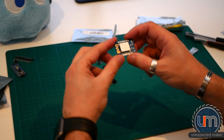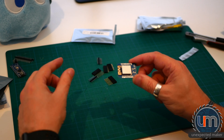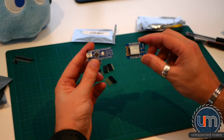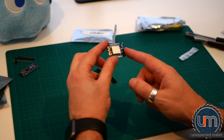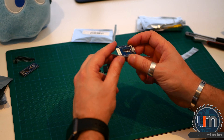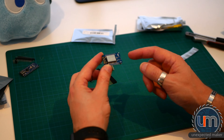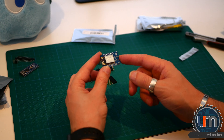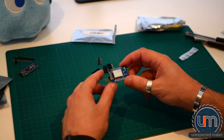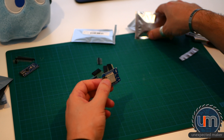These have less I/O pins than the Nano, for instance — as you can see there are fewer GPIOs. But they have Wi-Fi. I can program these to actually connect to the internet and be like a web server, or they can go online and grab data as a web client. There's all sorts of things we can do, and they're actually quite small. I've got three of those, and I've got some projects coming up that require internet connectivity.